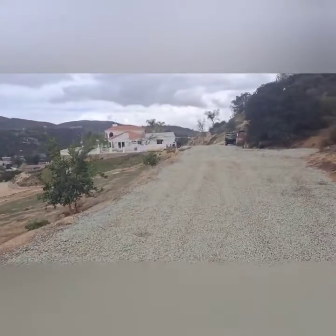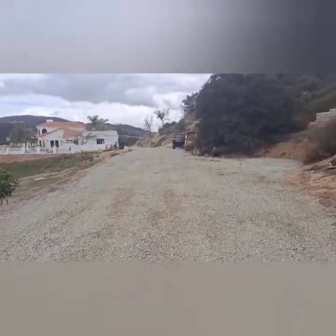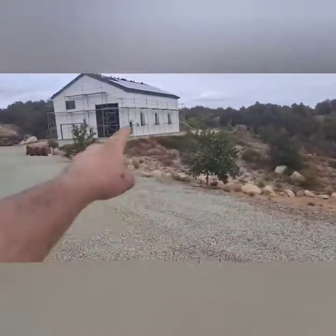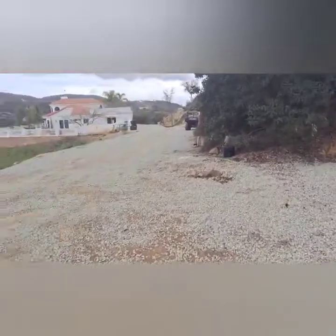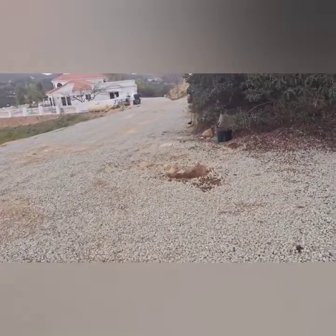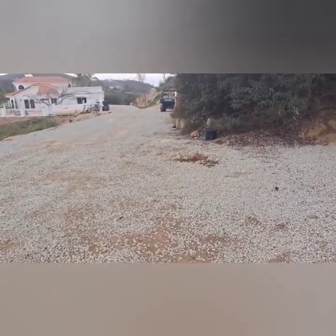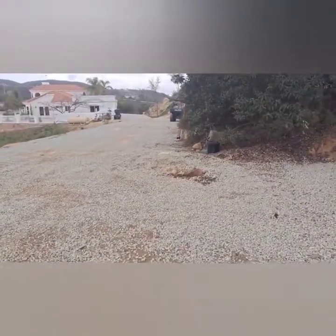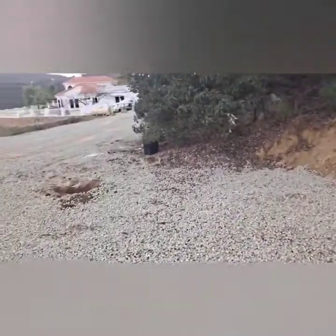I finished cutting out the area for the fire tank. This is 150 feet from the building—that's the max. It has to be 10 feet from the road, so the hookup is going to be within five feet. This is all cut out and leveled. I wanted to put it back so it's not protruding into the driveway. I had to level it and put a bed of gravel down. This is going to be 5,000 gallons full of water, so it's going to be heavy.